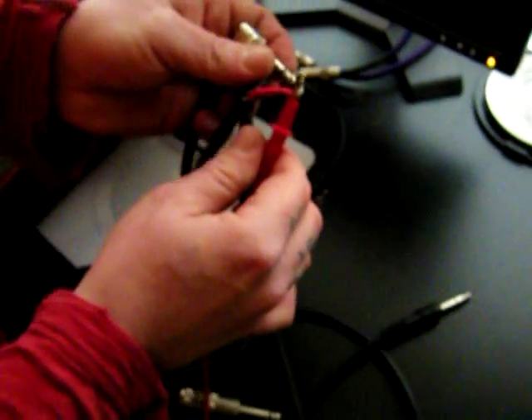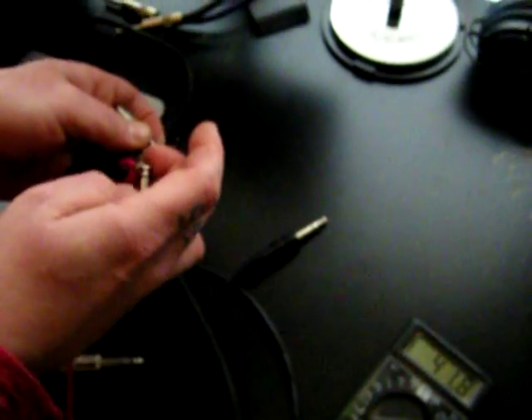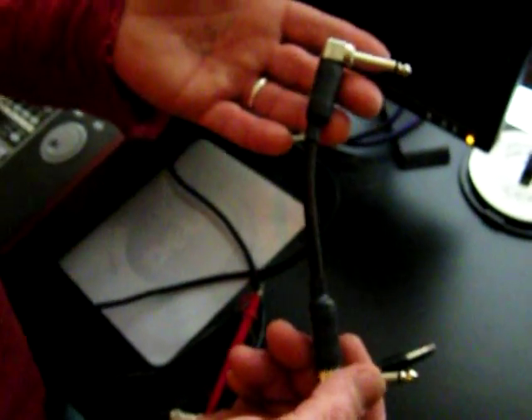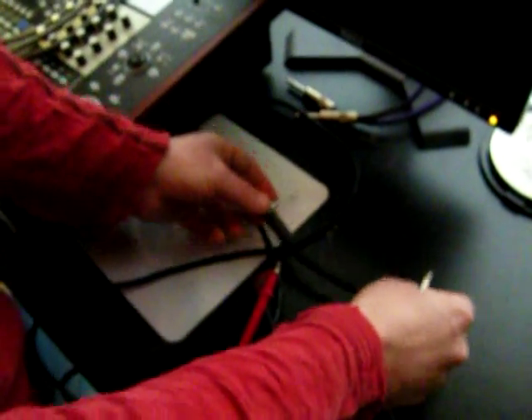Now, if you touch the sleeve on one end with the test lead and the sleeve on the other end with the test lead and you don't get any reaction out of the multimeter, then the cable is bad somewhere. It takes further testing equipment to figure out where the signal break is in the cable — whether it's at the soldering lead or if there's something defective within the cable. But really, you've gone as far as you need to go. The cable doesn't work — toss it, get a new one — or the cable works and you've eliminated it from being the suspect in whatever problem you're trying to solve.